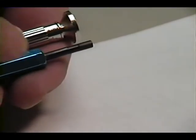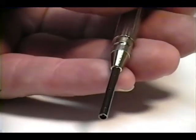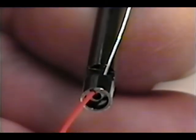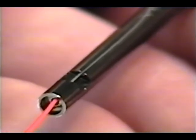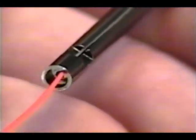Here are the two types of tools available for wire wrapping in EE-455: the blue tool and the silver tool. Each tool operates a little differently, but fundamentally the wrapping aspect is the same on both. Wire is inserted into a slit machined into the side of the tool. Down the center of the tool you'll see a hole, which is designed for placement onto the wire wrapping pin itself that you want to apply the wire to. Make certain that you don't get the wire wrap wire in the center hole — that center hole is intended for the pin of the socket itself.